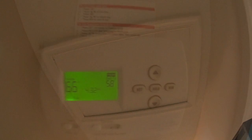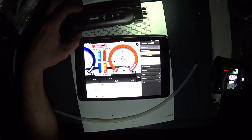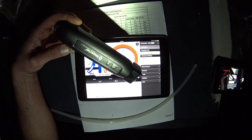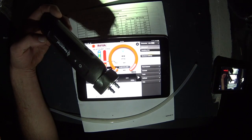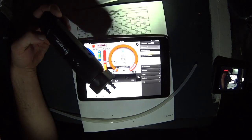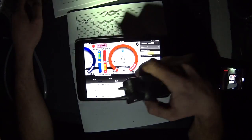I'm going to need to grab a ladder to get up in the scuttle hole up there. So we've got the new Imperial I-Manifold static pressure meter here. We're going to go ahead and tie it to the return first and see what that return static is, and then we'll bring in the supply.